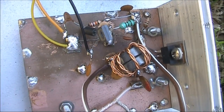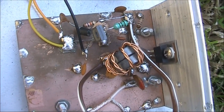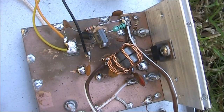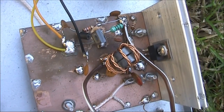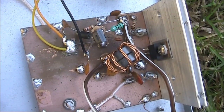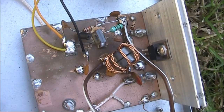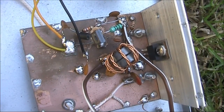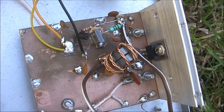So that's the circuitry — surprisingly very few components. On a components-per-watt basis, this transmitter would be almost unbeatable. It's really the modern version of the crystal-oscillator/power-amplifier two-tube transmitter that was popular from the mid-1930s. Those were also popular projects later on, particularly in the United States where the Novice licence only permitted crystal control. You would commonly have one tube for the oscillator and another for the power amplifier, getting around 40 or 50 watts DC input — within the then Novice power limit.